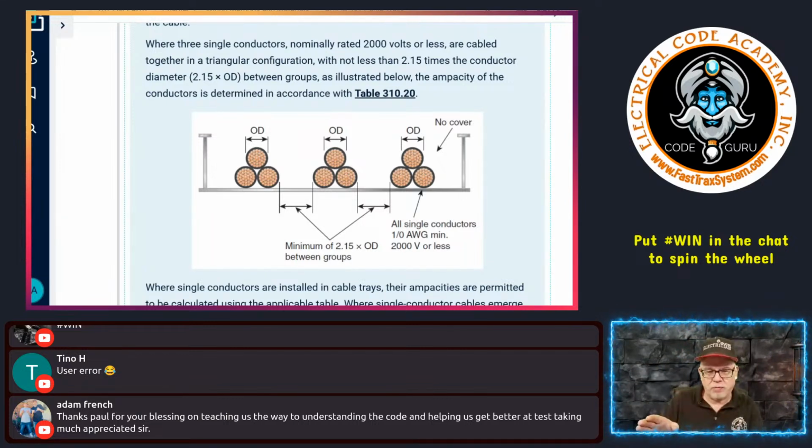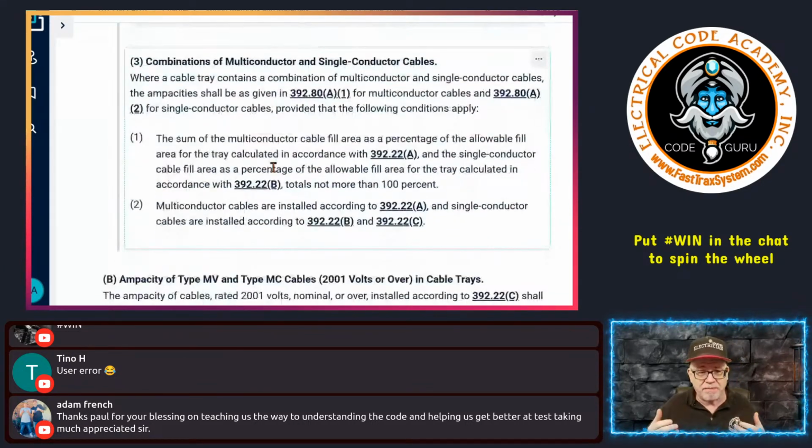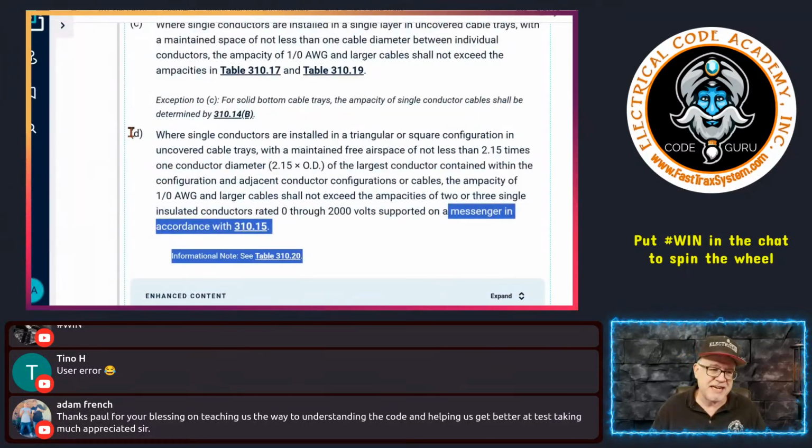So basically, it's going to let you use that ampacity under that condition, but you have to lay it out like that. That's the only way you can do it. And sometimes in a crucial situation, the tray has already been defined and the engineer is already designing it, and you realize you don't have a conductor that can handle the ampacity, even if it's a couple amps under. Then a savvy engineer may say, we're going to do it like this, and this is how you configure the actual conductors in order to get a little more amps out of it. But at the end of the day, guess who's responsible? If they give you that kind of direction, then the engineer is responsible for that. Okay, you with me? Just want to make sure that we're all on the same page when it comes to those engineers. All right, so that's D.